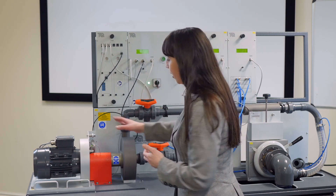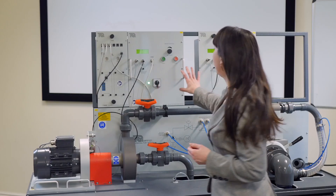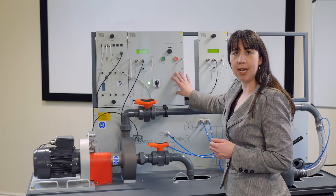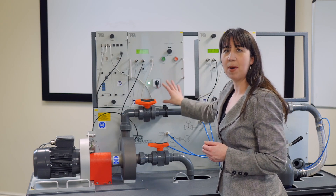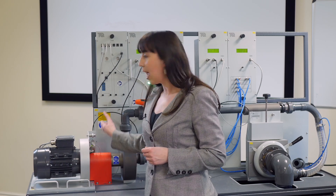As you can see, it has two parts: the electric dynamometer and a motor drive and display unit that we can see here. The dynamometer is an induction motor trunnion mounted to allow it to move freely against a strain gauge load cell. This is an inductive sensor that measures the shaft speed, and a load cell that measures the shaft torque.